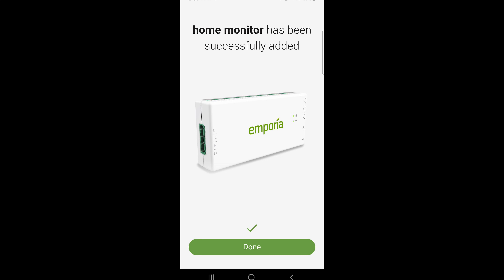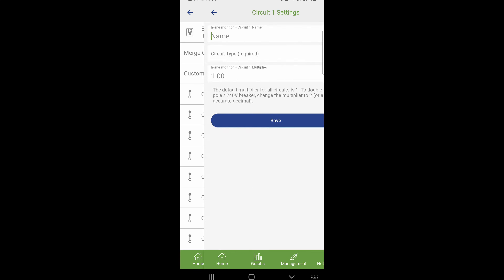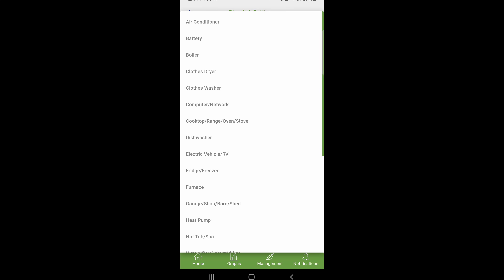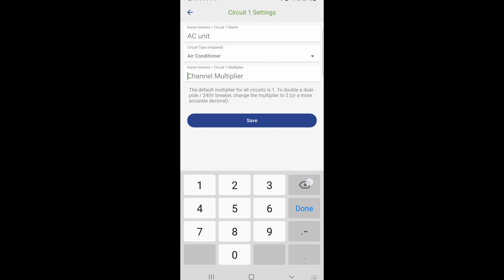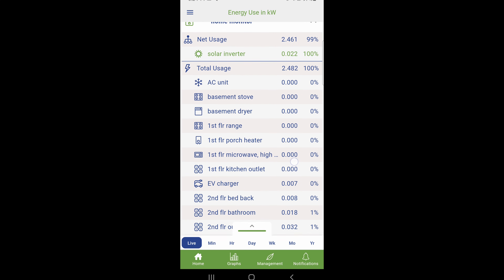Click Done. Once you get to the screen, click on the first circuit, give it a name, and set the circuit type — for example, Air Conditioner. The multiplier is 2 for this, because the house AC unit uses two phases to get 220-volt AC. I only use one clamp to monitor one phase of the AC unit — it doesn't make any sense to use two clamps for the two phases. We're going to fill out all of the information going all the way down to circuit number 16.